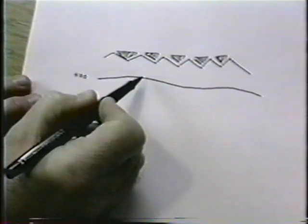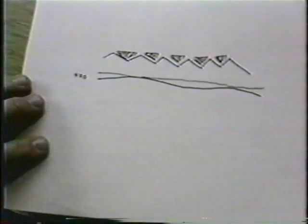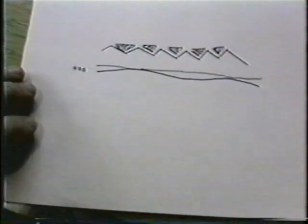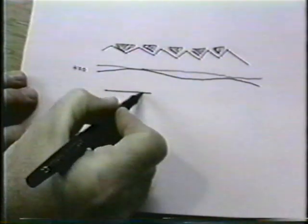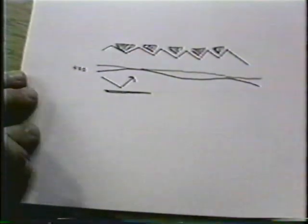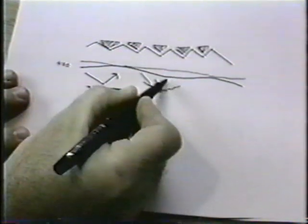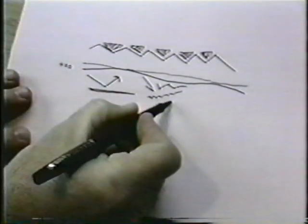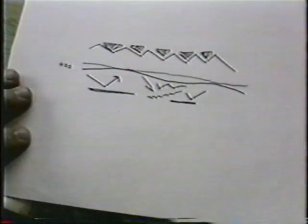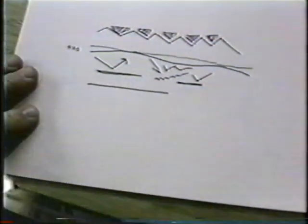If the wood isn't flat, you're going to have to fill in all these areas that aren't flat to get a flat finish. And flat is shiny. Shiny is flat. Anytime you can make a surface dead flat, light is going to reflect off it like on a diamond and reflect back and be shiny. If a finish looks like this, half of the light goes this way, half goes that way, and it never shines. A diamond reflects light because it's perfectly flat. It hits a surface and it bounces back. If you're looking for a shiny surface, it must be flat.